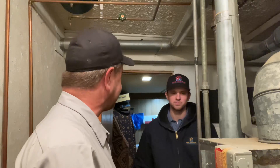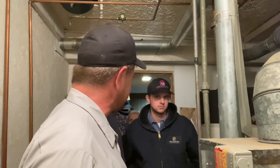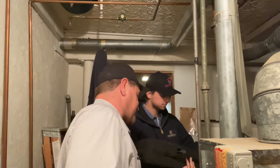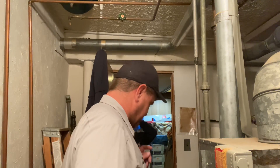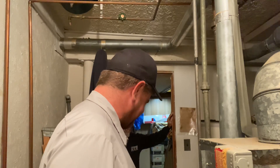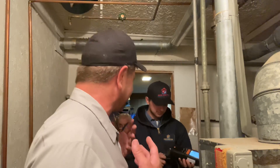Kind of like yesterday's Repco boiler that was 65–70 years old, that we rebuilt — the two-handle shower tub valve. There are certain boilers that if it's not broken, don't touch it. We have a hole through the flue pipe — actually, we have the diverter below. We're going to turn the boiler on, turn our Testo on, and turn one of the zones of heating on. There's just one thermostat in this house. We're going to make sure the boiler's circulating and tell them to have a nice day — because when this thing dies, that's when we'll change it. He's got a 65-year-old Repco boiler that he's put at least $10,000 into — he could have replaced it at least once already. But until this thing is dead, we're going to keep making it alive.